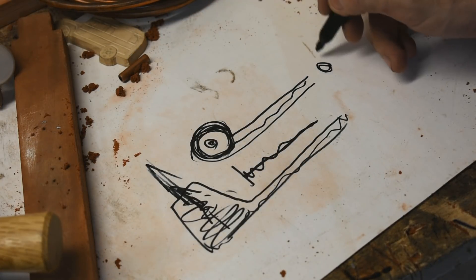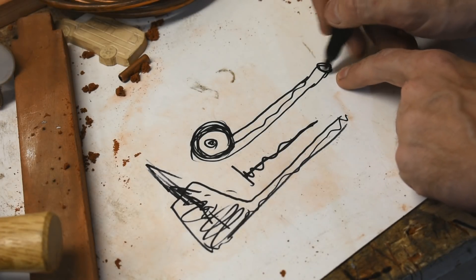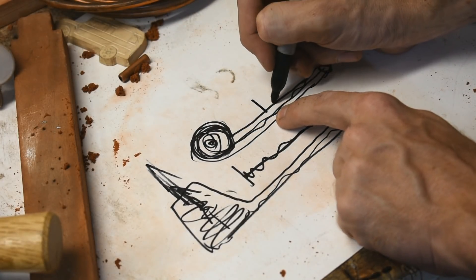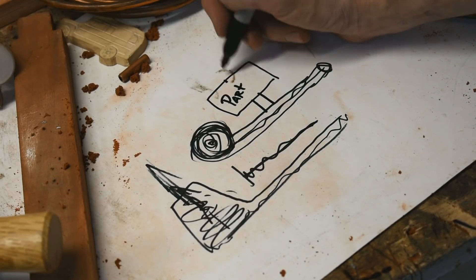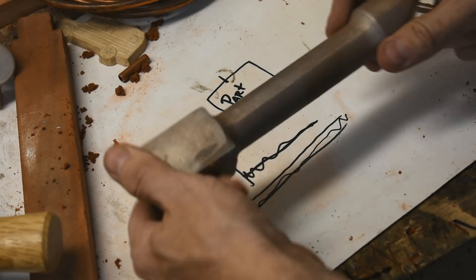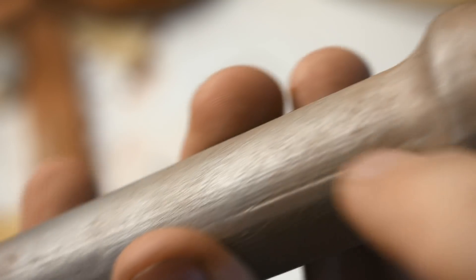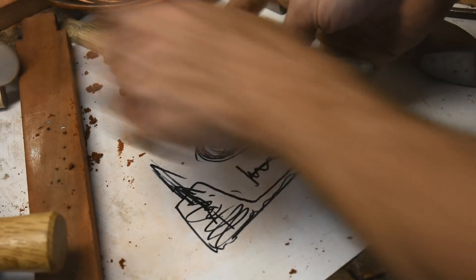Now remember: tapered sprue to slow it down. You don't have a big transition of diameters. Metal goes in, goes through the spin trap, and overflows into your part. You might need a vent on your part also, and feeders and all that — depends on the part. This system I've just recently been using, and it got me this great surface finish — remember that video? These are print lines. That's some great surface finish. It's worked out quite well. I'm going to continue using this system from now on.